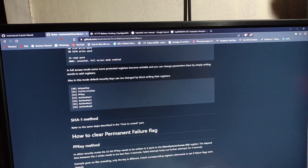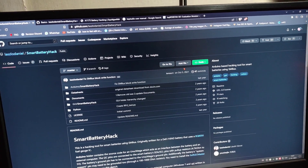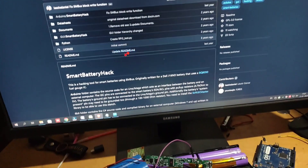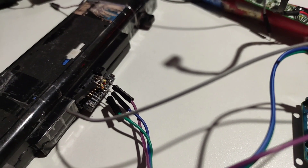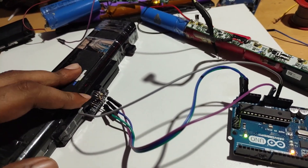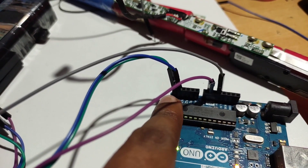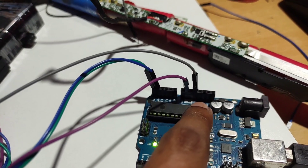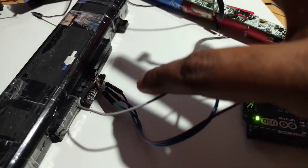Let's get to the code. You can download the Smart Battery Hack from the description box. I am using pull-up resistors here — 4.7 kilo-ohm resistors. In the previous videos these were not present, but this battery is hacked with this setup, so please follow along. The 5V line is connected, A5 is the clock, A4 is the data, and common ground is connected. The pull-up resistors connect from 5V to the clock and data pins.